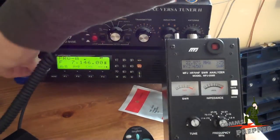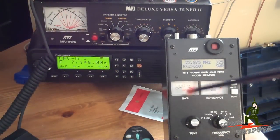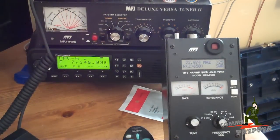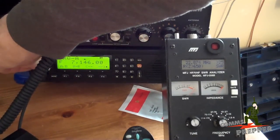We were hoping to show the antenna results on the SWR meter, but the needle seems to be stuck, so I'll need to do some troubleshooting and may have to replace the meter. The antenna is a little too long — it's resonating a little lower in frequency — so we're going to have to bring it down and shorten it up. That's just the nature of cutting your own antennas. I'm going to wait until it's a little warmer, but even with the antenna tuner we've had no problems tuning in stations on the 40 meter band.